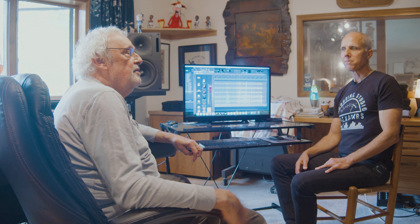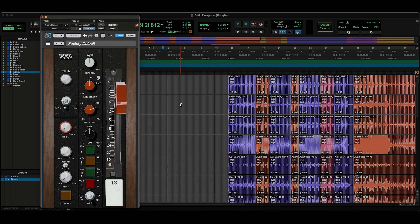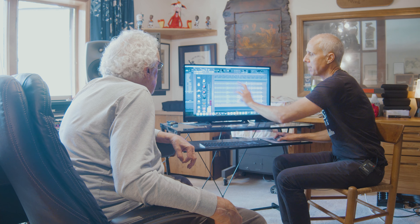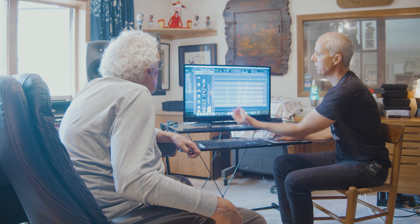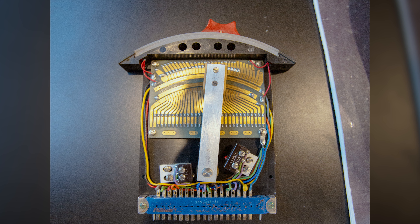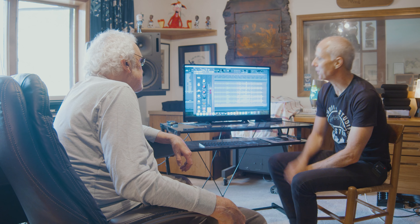It reacted audio-wise like I thought it would. This was a really nice detail too — when you grab the fader and bring it all the way down to the bottom, the mute light comes on, so you knew that channel was muted at that moment. There was also a backlight on these that would give a little glow behind the plastic. The fader was designed on the inside as a series of stepped resistors, swiping across all the different connections. Occasionally on a bass, if I did a fast sweep up and down, you'd get a zipper noise.